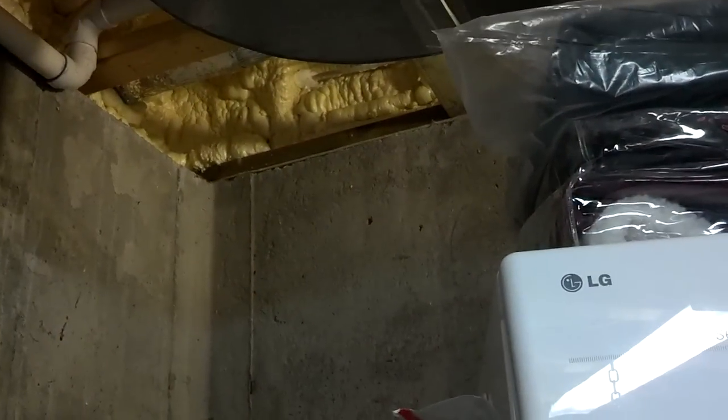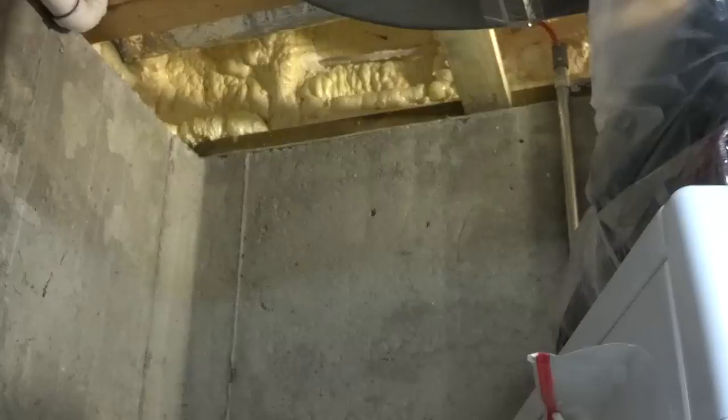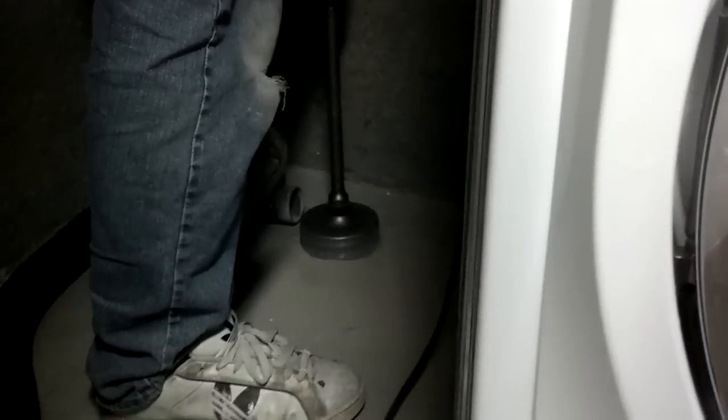It first starts by drilling a hole through our 6-inch concrete floor to tap into our sump line, so that we can basically suck the bad radon out from below the concrete, depressurize that, and pump it out into the atmosphere instead of letting it creep into our house. We're going to run it all the way up the concrete wall, punch through the foam there, end up in the garage, go up into the attic space, and that's where we're going to put the fan. The fan's going to suck air from below the concrete pad where the radon is and then vent it up into the atmosphere out the roof.